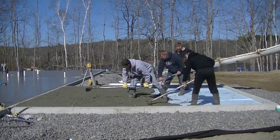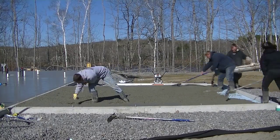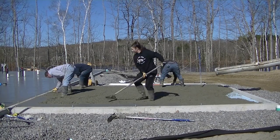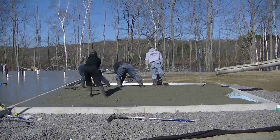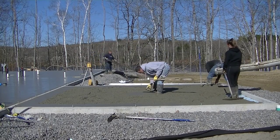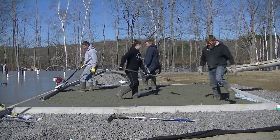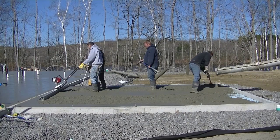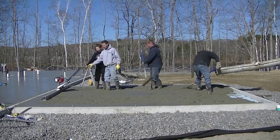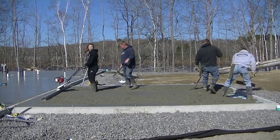Here's where you're going to see if Tia is really going to vibrascreed or not. We had this little patio out back — about 20 by 18 — and we're going to see if she can run that thing. I'm getting the edges all magged, getting my pad shot in the middle, getting that struck, and then I'm going to get the vibrascreed on there. I'm just showing her the angle you need to have it at — you give it a little bit of throttle and pull back nice and even on it. We'll see how easy or hard it is for her to run.